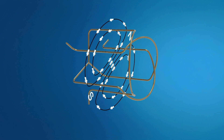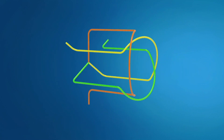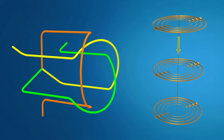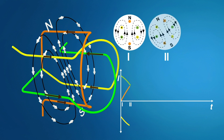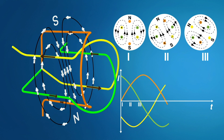It is precisely this rotating magnetic field, or RMF, that causes the rotation of the rotor. To better understand how the rotating magnetic field and its properties are generated, let us take as an example a simplified version of a stator winding. This winding consists of three coils connected 120 degrees apart. A current-carrying wire generates a magnetic field around it. If we apply three-phase electric power to this coil arrangement, the magnetic field will be generated at a specific moment, as shown. Following the variations of the alternating current, the magnetic field will assume different orientations and form. When we compare these three results, we can see that it is like the rotation sequence of a magnetic field of uniform strength.